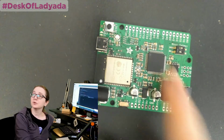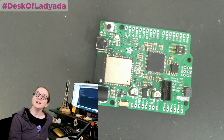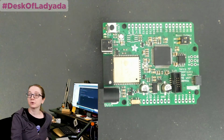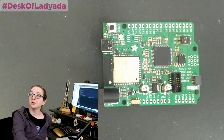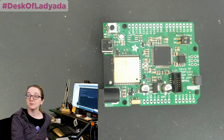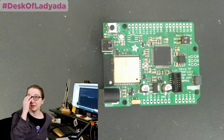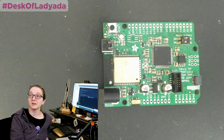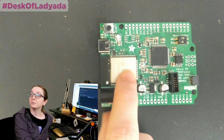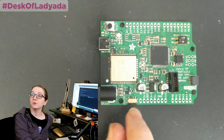So this one has 128K of RAM. It's not tons, but we got it to do a bunch of Wi-Fi projects in CircuitPython. You're able to do it because you have a huge flash memory, so you can put a bunch of libraries in flash instead of loading them into RAM off disk. So it's got AirLift, SPI to Wi-Fi and Bluetooth LE.